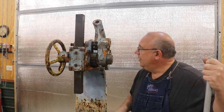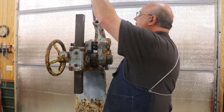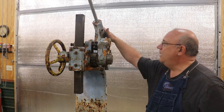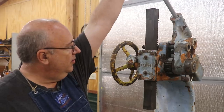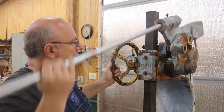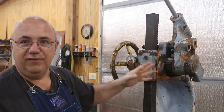Additionally, if you want to get more force going down, you use the ratcheting lever here. There's a handle that comes out of the top — I'm missing the handle, but I can fabricate one. I'm just sticking a piece of conduit in here for demonstration purposes. Right in here we have a little geared pawl-and-ratchet mechanism. There's a little tab on the back that pushes on these teeth — it only goes in the down direction. When you pull on this handle, it pushes down one click at a time, putting about 12 tons of downward pressure. Nice little feature for heavy duty pressing.